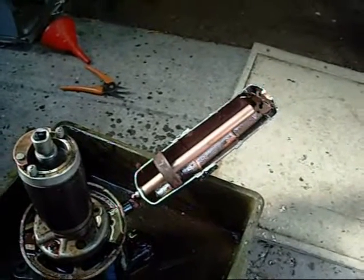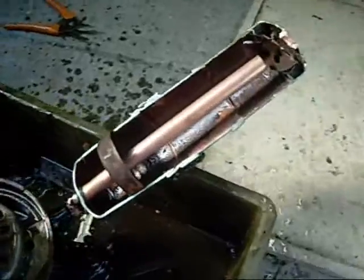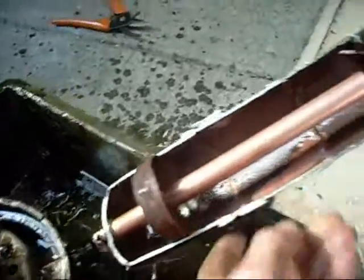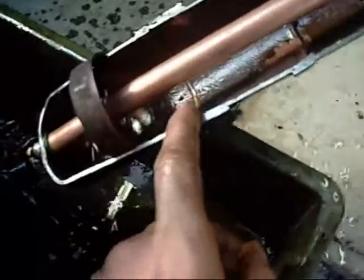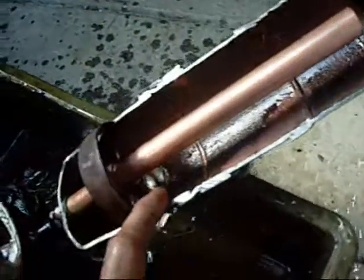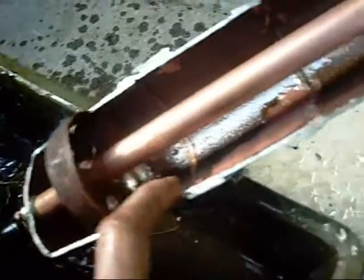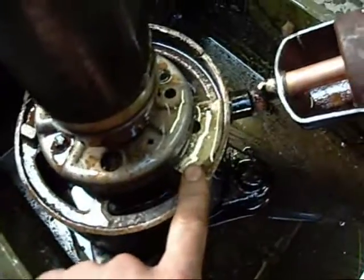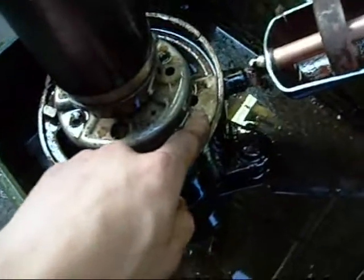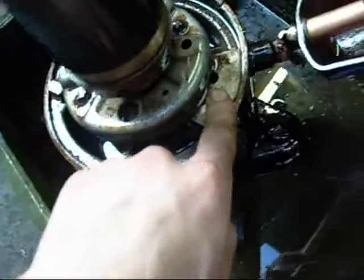Another thing I wanted to discuss is the suction line accumulators that are attached to the sides of all of these rotary compressors. Obviously this one's not always standing vertically, but the purpose of this device is to catch liquid refrigerant in the bottom here by diverting it with this baffle and screen down the sides of the tube and evaporate, or allow it to evaporate, before the gases can go down this tube and into the compressor to be compressed again. If liquid were to drop straight down into the compressor, it would have the effect of water in a car engine. It would hydraulically slam the rotor and the seal. That's called slugging in the refrigeration industry.